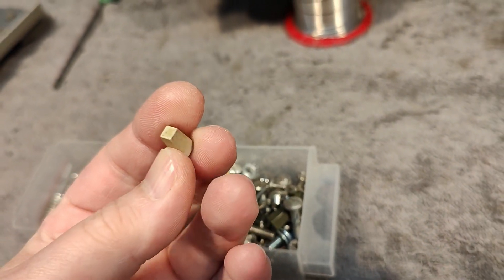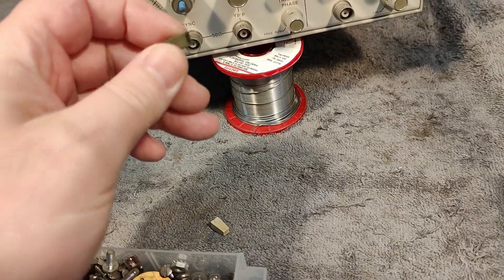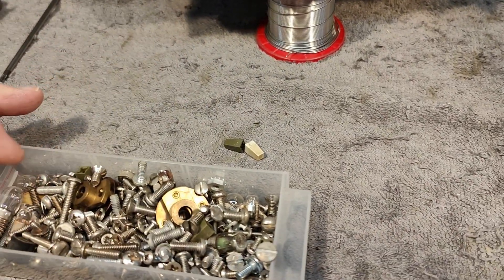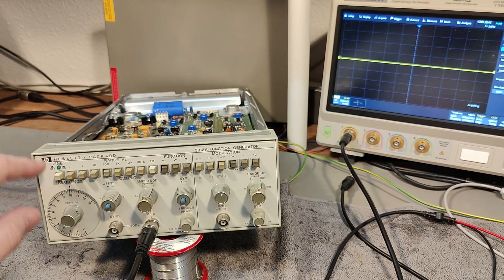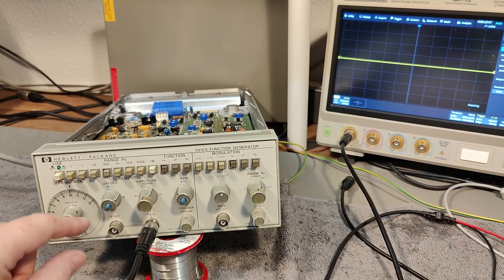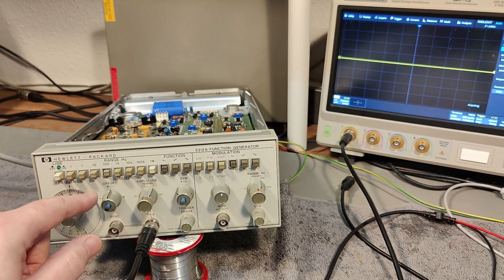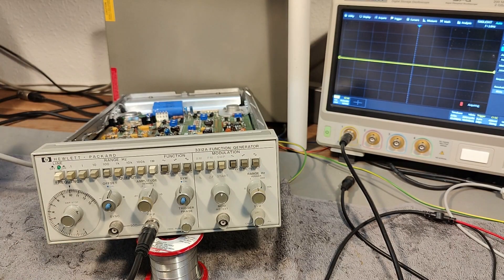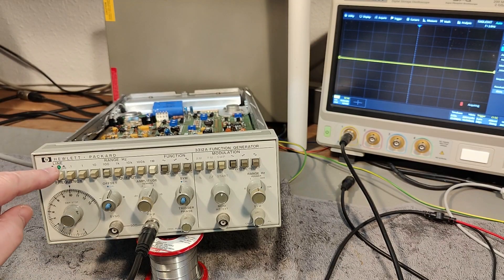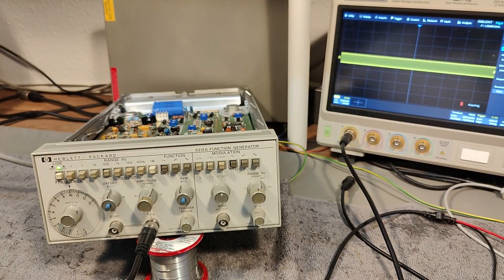I need to clean this a little bit, but I bet it's more or less the same size and type. I put everything to normal, expecting one kilohertz. Push the calibration — that means it's probably not running with offset or symmetry. All we have to do is power it up. That was zero watts, so this switch is indeed mains. And immediately, look at that — we've got a little pulse.